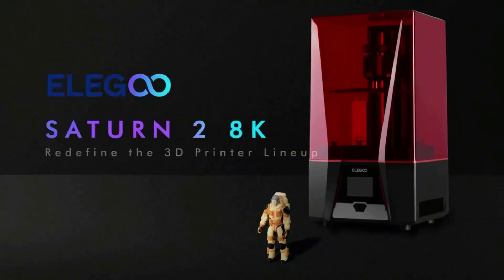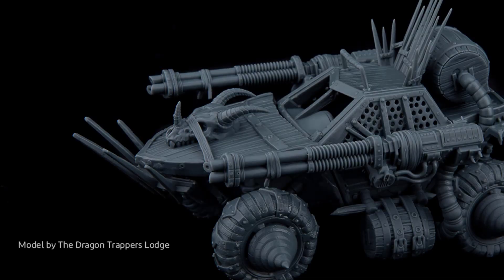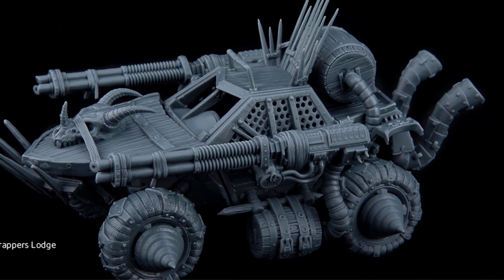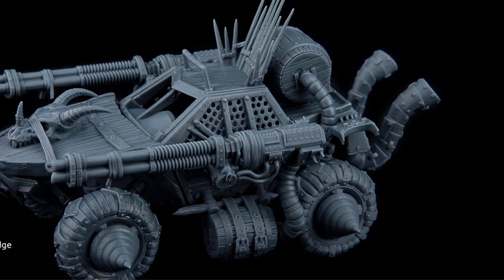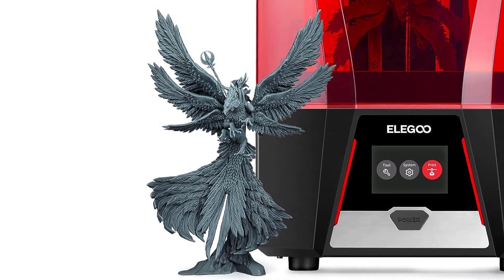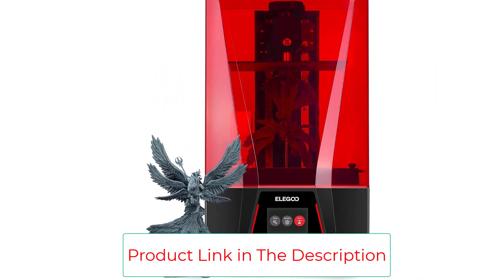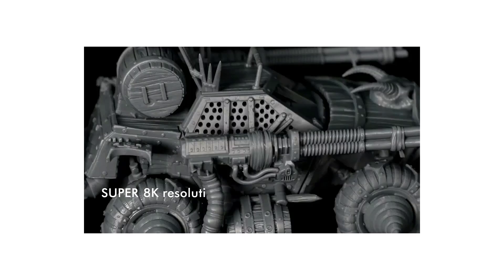The Fresnel Collimating Light Source consists of 48 highly integrated UV LED lights that work with a Freeform Surface COB Lens and FCL System Fresnel Lens to emit a uniform light beam of 405nm wavelength with 92% light uniformity, delivering excellent printing accuracy and a smooth surface finish.